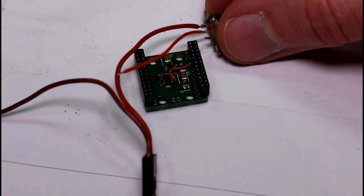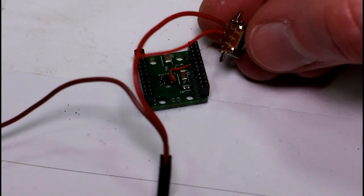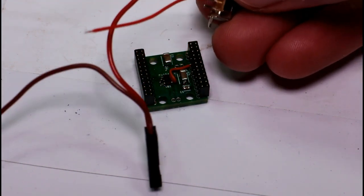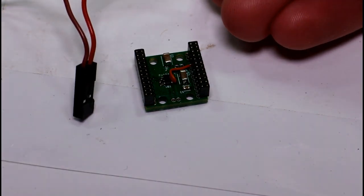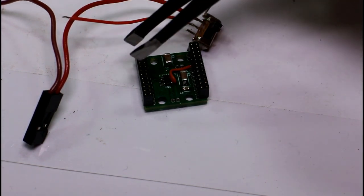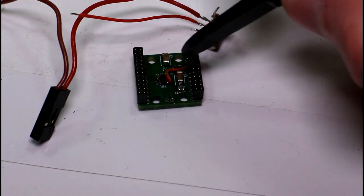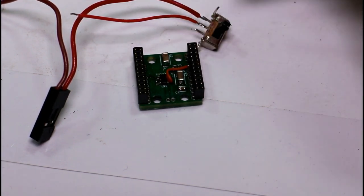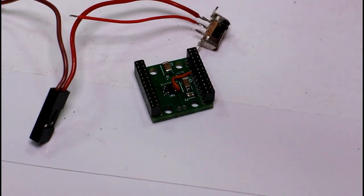I also put together a little switch and cut a hole in the side of the trailer plastic. I'll hot glue this in — this will be our connection to a 3.7V LiPo battery. Then we can wire up the motor and the switch to this little control board and see how it works. I'll also drill four holes and mount the board securely to the plastic body of the trailer so we can plug and unplug the controller nicely when programming it.